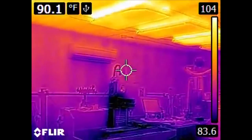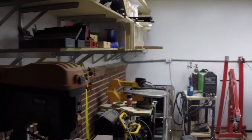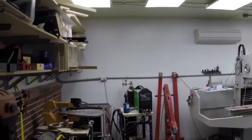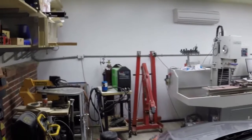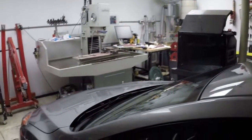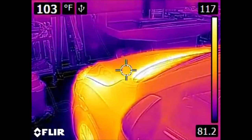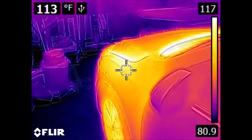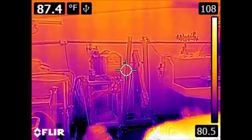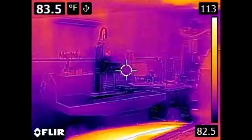Hopefully this gives you an idea of the kinds of things you can see and find with a thermal imaging camera. These cameras are actually quite expensive — this E4 model, the lowest in the E-Series that FLIR makes, runs around $1,000, and it is the bottom line for this type of camera. However, you can find places that will rent them to you. Most of the time you will use them to identify problems and concerns within a structure, and then you are done with them — you might possibly rent it once more if you wanted to verify that your fixes actually worked. The best time to use these devices is generally when you can get the greatest contrast, either in the hottest or coldest parts of the year, and it will also change what you are looking for — the hot spots or the cold spots. Because it is 90 degrees outside now and mid-70s inside, the hot spots are what we are looking for. The opposite would be true in winter. Winter, however, can give you a lot more contrast because the temperature difference between what humans are comfortable at and the kinds of climates we live in is significantly more extreme in terms of absolute temperature during winter.